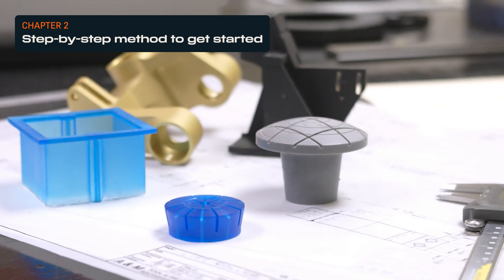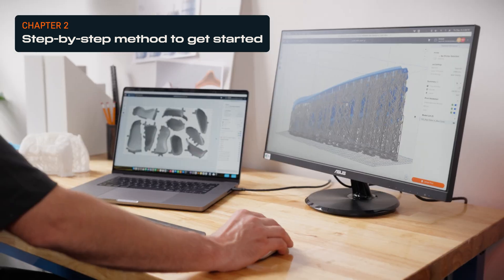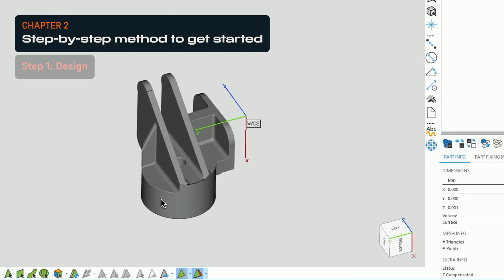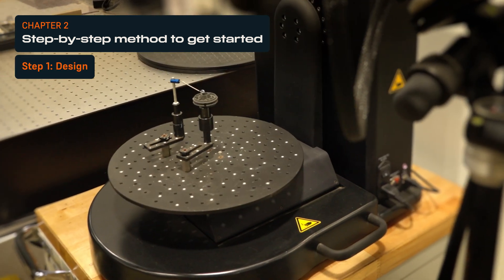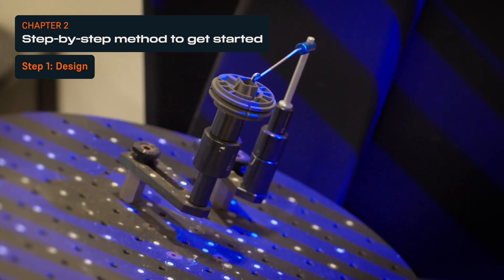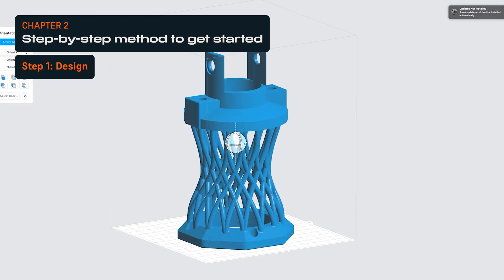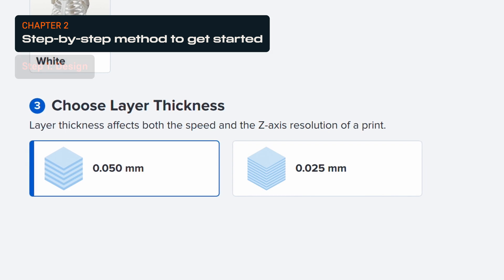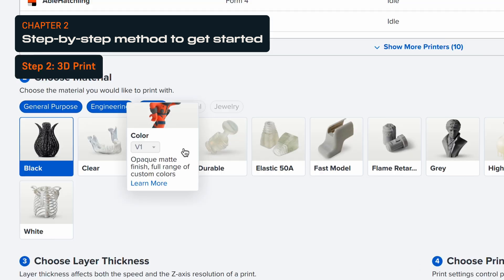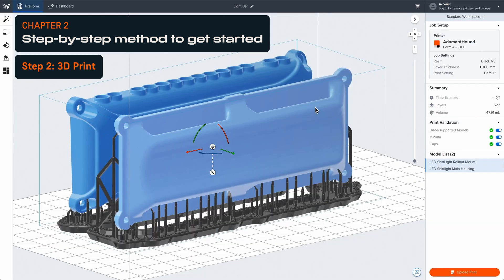To make these customized jigs and fixtures, follow simplified digital workflows for design and 3D printing. Formlabs offers an easy-to-use, complete ecosystem to get you started. Begin by building a model of the tool in CAD or reverse-engineer it with 3D scanning. Leverage the design freedom enabled by 3D printing to introduce complex geometries, reduce the material and number of assemblies, and increase modularity and user experience. Prepare your models for 3D printing, choose your printer and material, and 3D print the tools in just a few hours.